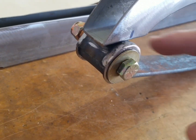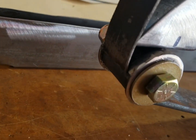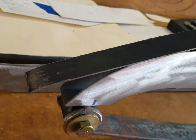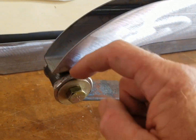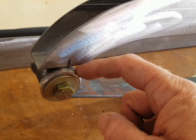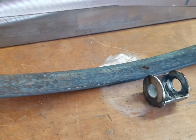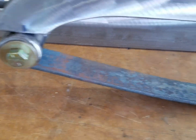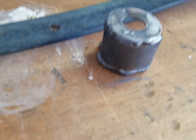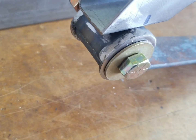This is going to be welded onto here, and then we're going to take this flat strapping — it's going to get welded onto the front and then pulled around onto the top of the frame, flushing out here. This will be welded here, and down here I'm going to put some little filler pieces — I might just fill that with weld because it's not going to be a whole lot of space. Then this bottom is going to get a one-inch piece also around the whole bottom. So I'm going to go ahead and clean the welds up, grind them down a little bit so they're a little smoother — just cleaned it sort of flush because it's going to get welded around here anyway.